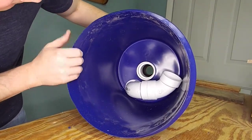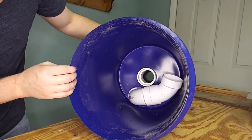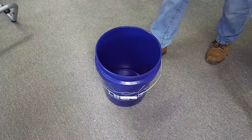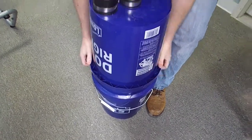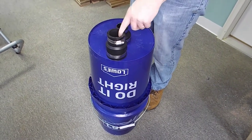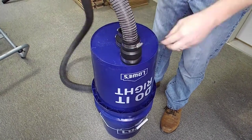There's what you have — the vacuum port and the dust inlet port. It's pointing at about a 10 or 15 degree angle toward the bottom. That way you get this cyclone action that drives the dust into the collection bucket and not right back up through the vacuum hose into your shop vac. I think we're ready to put these together. For the intake hose — the hose that will actually hook to the tools — we are going to use the hose from our old shop vac and put it in here.